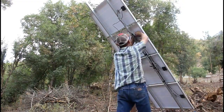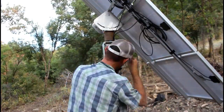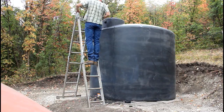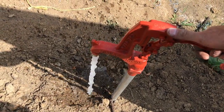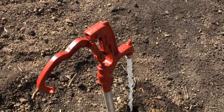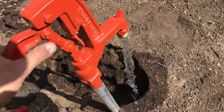This is the lowest, driest this well should ever be. I don't want that well pump sucking sediment up, and the well's been sitting for a couple of weeks so the water's actually quite clear. Following the instructions, I installed the control panel and wired it up as specified. There is a low water float that shuts the pump off so it never runs dry, and there's also a tank float which shuts the pump off when the tank is full. Based on experience, I'm guessing they've considered everything.